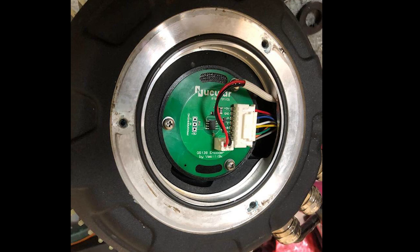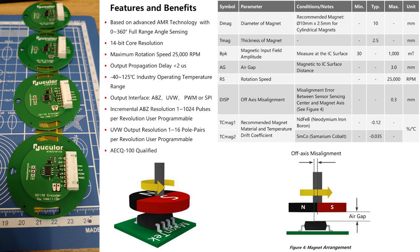If you have a hall sensor motor, by changing to an encoder motor you will have up to 30% better start torque from zero speed and less current ripple at high speed. This is because hall sensors are very discrete and don't have enough accuracy at the start.